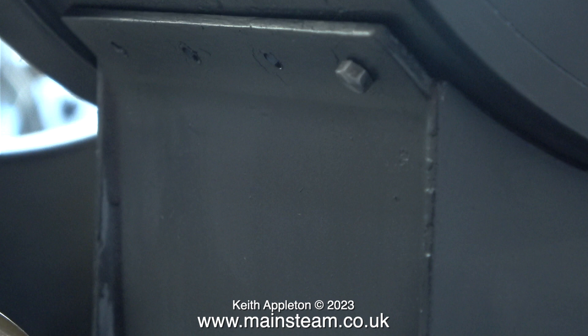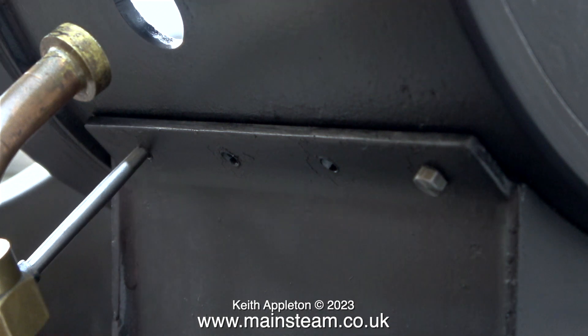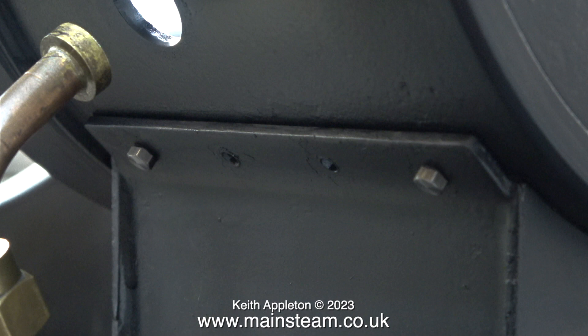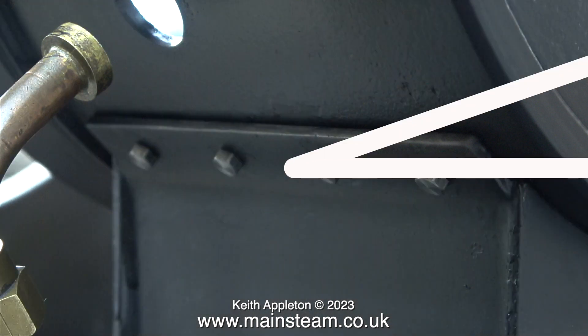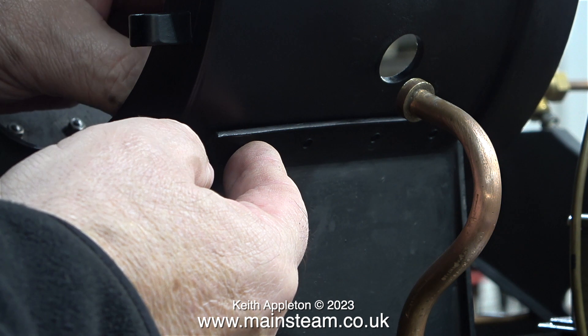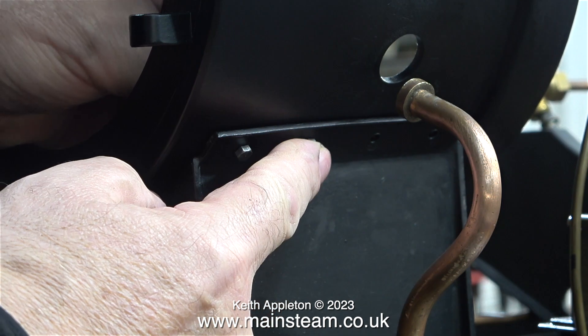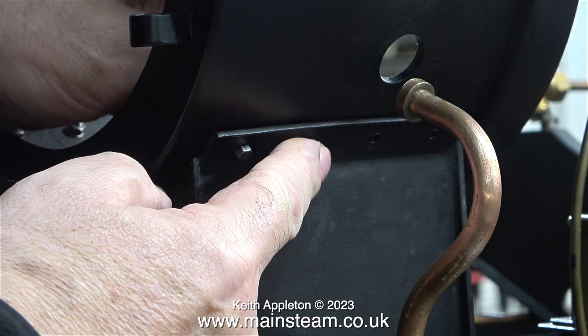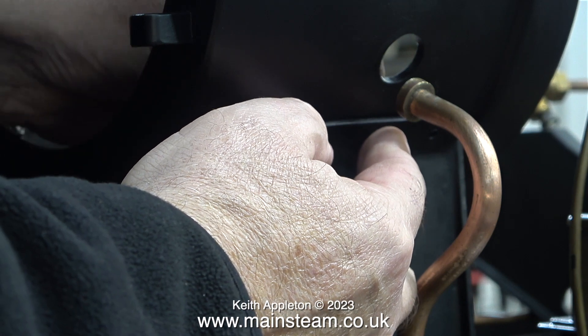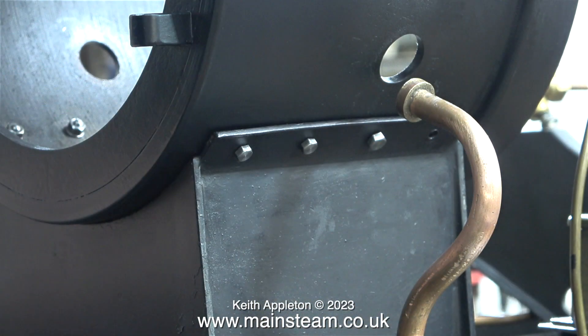After lining up the holes with the scriber, the bolt went through okay, and on the other end I fitted a washer and a nut. To check there wasn't any twisting going on, I used the scriber to check the alignment of the other side, and that was fine too. Believe it or not, when you mark out and fit a smoke box to a smoke box saddle, it often does not fit quite as well as you would think. Thankfully this was okay. I fitted one bolt in each end, then filled in the rest — they all went in without any event. On each of them I fitted a washer and a nut, but only loosely; I will tighten them all once everyone is in place.